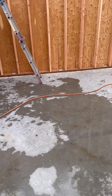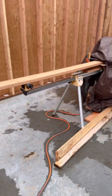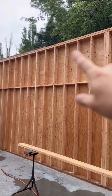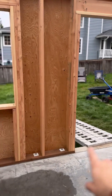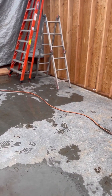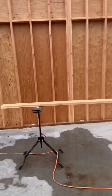This area is going to be the primary assembly space — maybe a rolling assembly table here. This area will be outfeed for the table saw, with the dust collector back in the far corner so we can run dust collection up the wall and down the corner before the vaulted ceiling, then drop over here. We can run it along this wall and drop down to the joiner and planer over there, with a floor sweep as well. Table saw drop goes here, bandsaw over there, and we're probably getting a drum sander too — another drop in the corner with a flex tube.